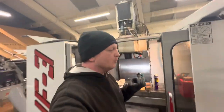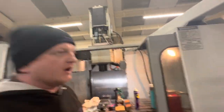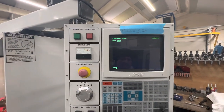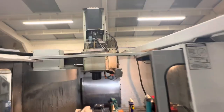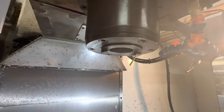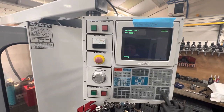Okay, now we're never going to hear the spindle bearings like that, but when I do that syringe full of oil, I'll run it at probably 100 RPM or 50 RPM for 3 or 4 hours tomorrow, so it's feeding oil until I get oil coming out of the spindle nose. So let's just not go too mad. Let's go S250. Now with these gearbox machines, it's hard to hear because the fans are so noisy. But obviously, seems good. I'm going to have to run it a bit faster just to be able to hear it. S500.